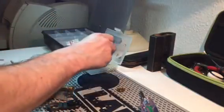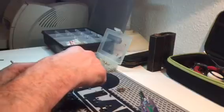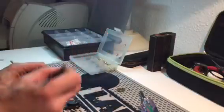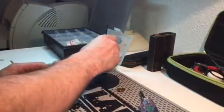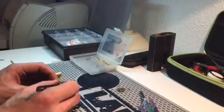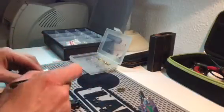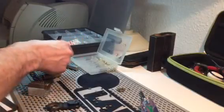The next one is a 3. We'll take the S4 again. For number 4, we'll take another S4. For number 5, it's a 1 cut, it's near shear line, so we take the S3 driver. And the last one was a 6, so we'll go with the S5, the one that you also use with the Ruko 1200s. So, there we go. Nice. So, we can put these out here for now.